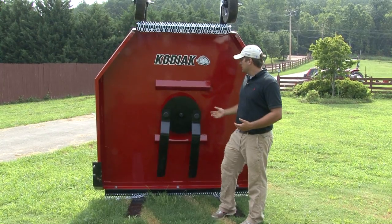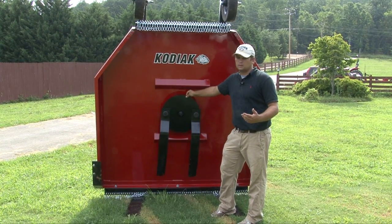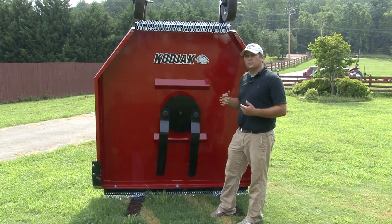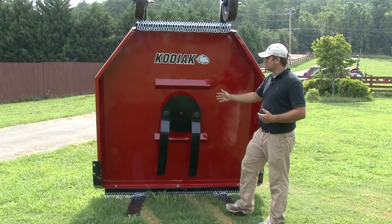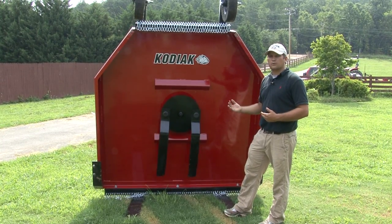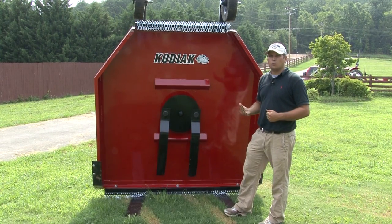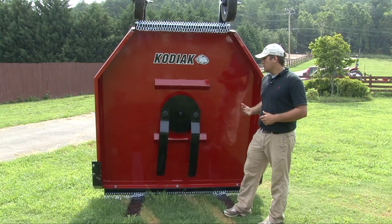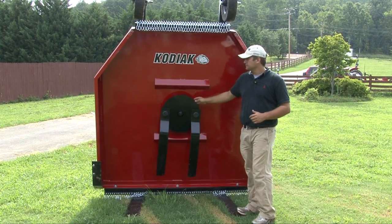Also, you get into something like 5/8 inch thick compared to something around a 1/4 inch thick. Say you're in something real rough, you slip your clutches. This 5/8 inch, the inertia of it is going to keep cutting while your clutches are slipping a whole lot longer than that 1/4 inch. And also there's the main thing of warpage and bending pans. Nobody wants to bend a pan. That's why we go with this beefed up thick pan.